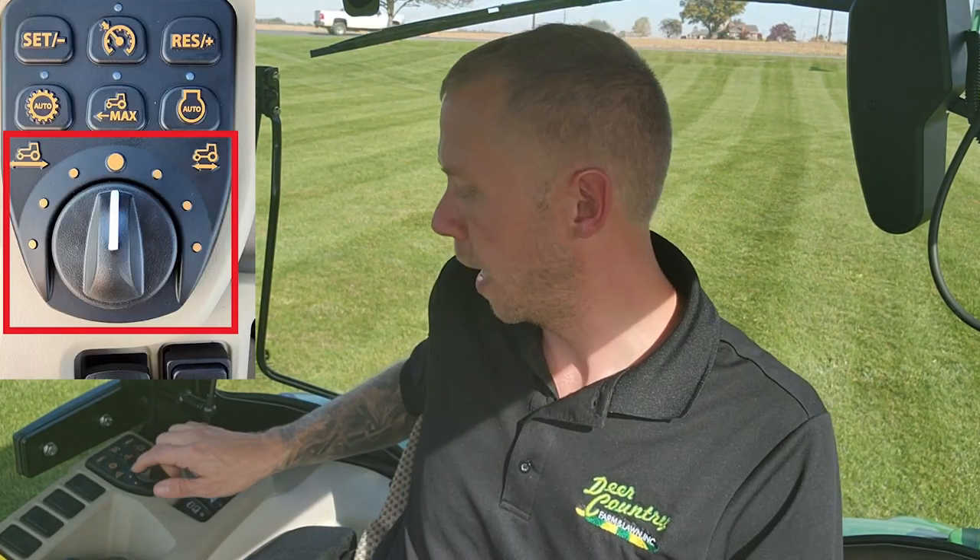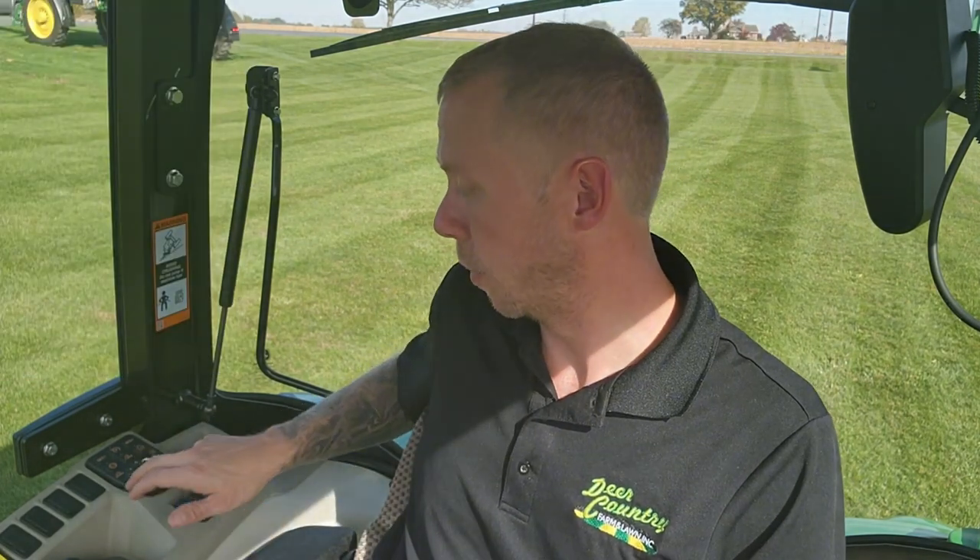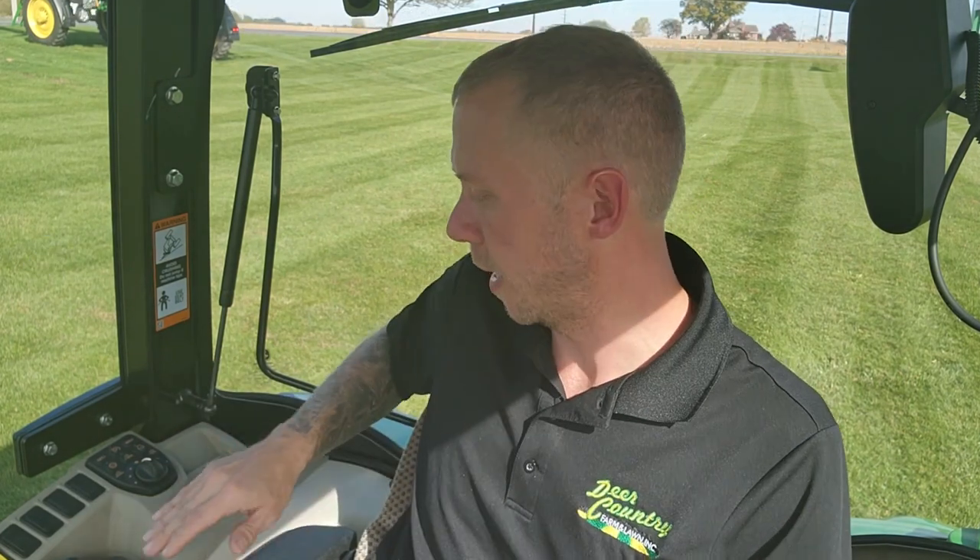The last thing we're going to go over is motion match. Motion match has a dial with a handful of different dots on it and two symbols at the top — one with a longer arrow, one with a shorter arrow. This allows you to adjust the sensitivity of the hydrostat when you let off on it. If you have it set for short distance, the tractor will abruptly stop. If set for long distance, the tractor will drift more. Depending on what type of work you're doing — whether loader work, field work, or navigating in a sensitive area — you can adjust it per the job. We'll go ahead and move the tractor onto the pavement so you can see exactly what it does.